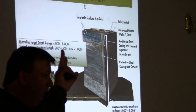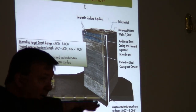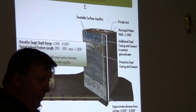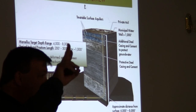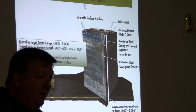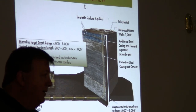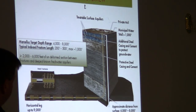Okay, so Shell has a two-barrier policy worldwide, whether it's drilling wells and the lateral barrier aspect of it, also the vertical barrier aspect of it. So you'll see on our trees, you'll see two master valves, you'll see two wing valves, you'll see two of matching of everything. And it's the double barrier policy that we have, that we carry with us all the way around the world, everywhere we go. And it's worked very well. Then we drill, starting here out of the intermediate casing, we drill this horizontal lateral.